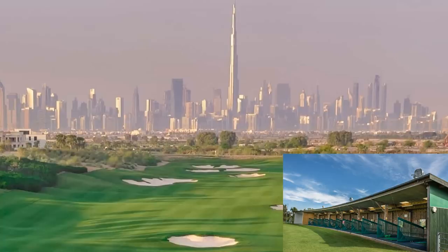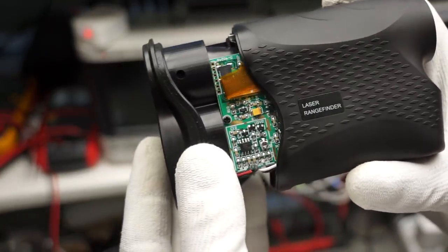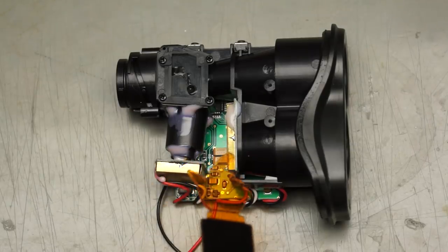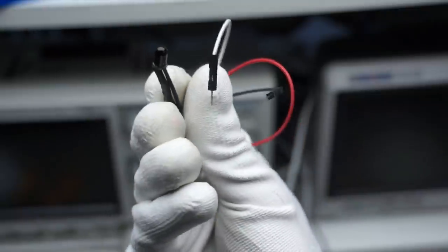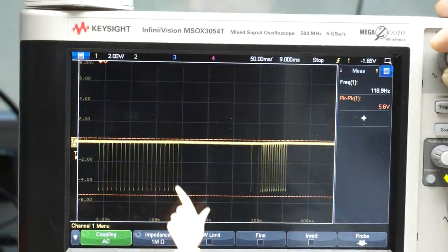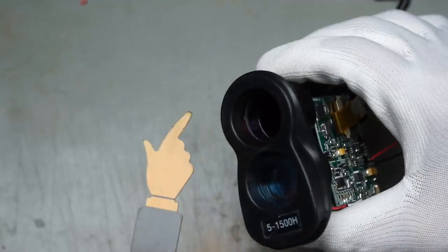The rest is probably interested in how this device works. So far, you did not see many teardowns on this channel. This time I have to do it because I am very curious to see what's inside. It was not easy to find the small two screws hidden behind the optics in the back, but finally I managed to get it disassembled without destroying the enclosure. The most important two parts are covered by a shield — one has to be the transmitter and one the receiver. Fortunately, we have simple means to make IR visible. I use a photodiode and a resistor, and if we connect it to an oscilloscope and press the measure button on the rangefinder, we see that the laser sends signals from the top opening. So the transmitter must be that one, coupled into the viewing path using a mirror.